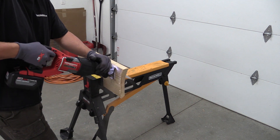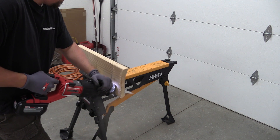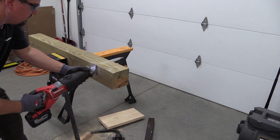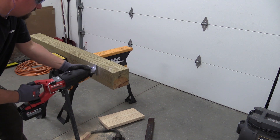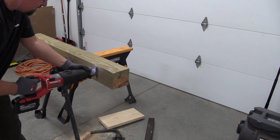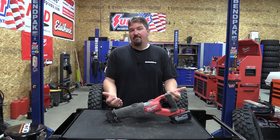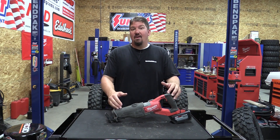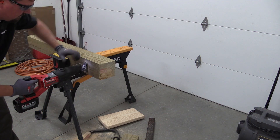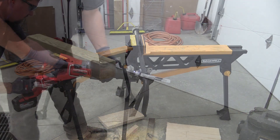You can see a huge difference in the amount of vibration felt in the handle from the 2x10 versus the 6x6, also caused by the vice holding the wood moving around. This thing does cause some vibration to come back to you when in oscillating mode. If you expect this to ride like a Cadillac, don't buy an F-250. This saw is meant for heavy-duty work. It's going to give you vibrations in oscillating mode. When you turn oscillating mode off, you can see those calm right down and it's very easy to use.